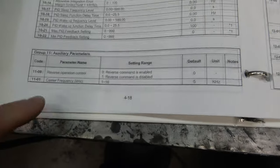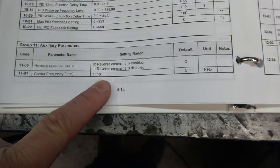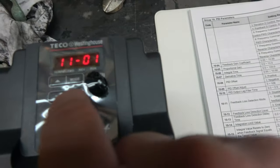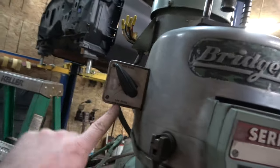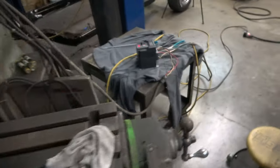You can see these things are relatively easy to adjust. Because it's running forward, we're not going to use the switch to start and stop the motor — we're going to use the VFD. I think I'm going to use control wire and use the switch remotely with the VFD, instead of running current through it. So I've completely bypassed this box.